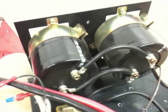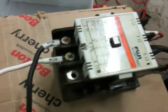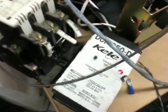From there we go up to our capacitor bank, which is two 1800 microfarad capacitors. There's our 100 amp contactor for controlling our current, and then some pilot relays. We've got our solenoid right here — a 24 volt DC solenoid. This 50 amp contactor will be our main contactor for turning power on and off to the unit. There's a little 24 volt power supply down here, just to power that solenoid and those two relays.